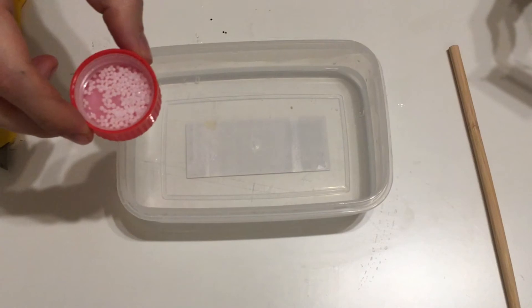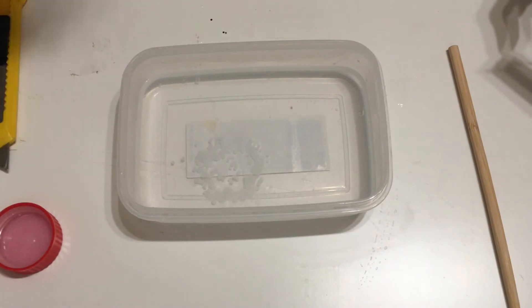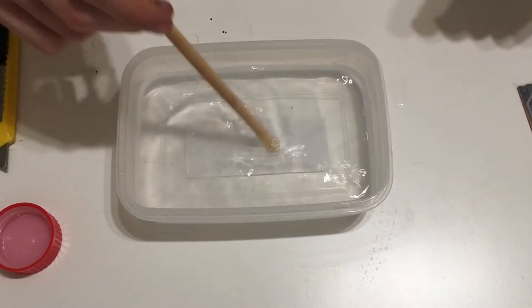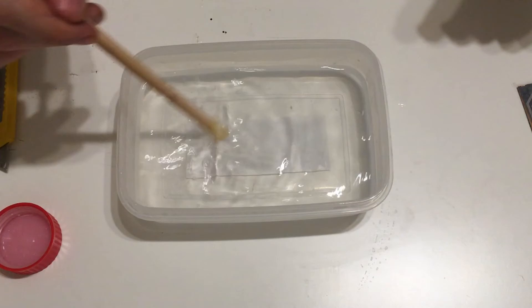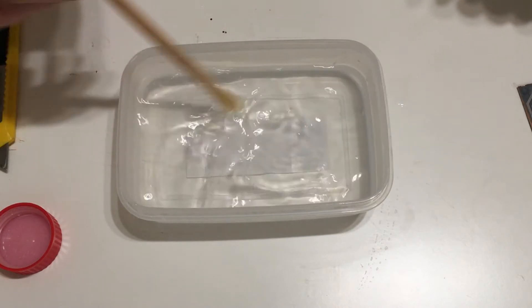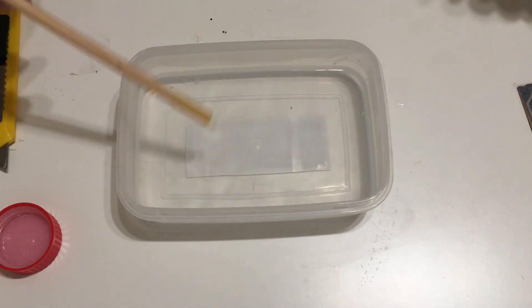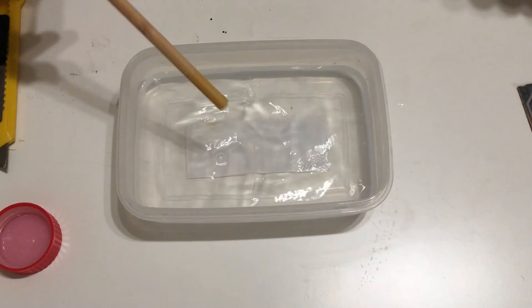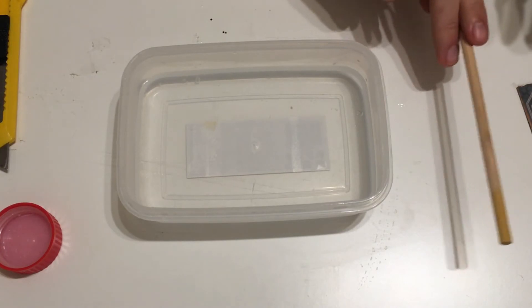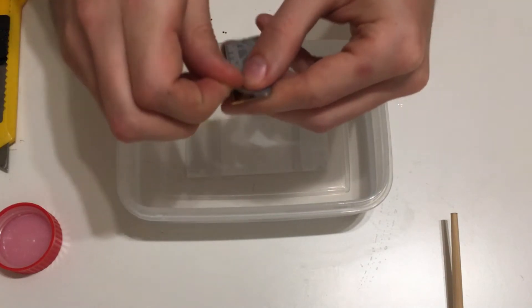Now we are going to prepare the solution of sodium hydroxide. I have 1.75 grams of sodium hydroxide measured, which is enough for a cup of water — more or less one flat teaspoon. I'm going to mix it well; the water is warm. It's very important that all the granules of sodium hydroxide are dissolved, because otherwise it might damage the photoresistive film on the board. Now we are going to peel the film off and wipe it clean from all the excess cooking oil, to ensure that it will be equally developed.